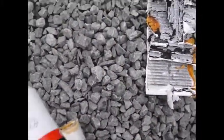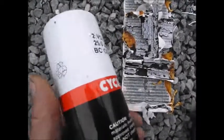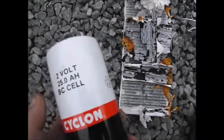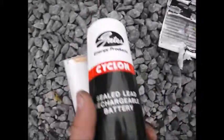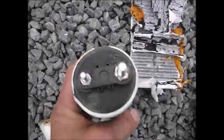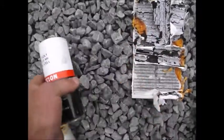So here we have it again — one of these batteries. Sealed lead rechargeable battery. Gates Energy Products is where they come from, and they're 2 volt, 25 amp hour. Pretty interesting. Now I salvaged some of these cells and actually got enough good ones to make a 12 volt battery. They sell these individually, so if one decides to burn out and becomes no good, I can always purchase another one and incorporate it in the pack.